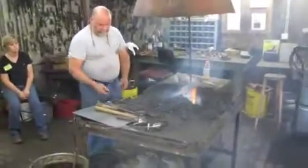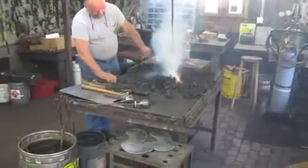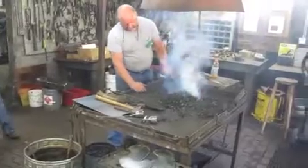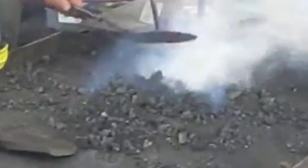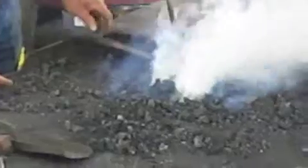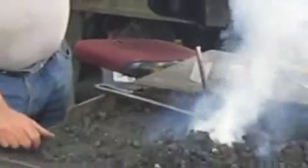You have a rake. Keep the coke on top of the newspaper. As the newspaper starts burning, it's going to hollow out, so you want to keep it tamped down a little bit. And you can open up a hole to allow the flame and the smoke to come out. If that window wasn't out, it would be going up the stack.